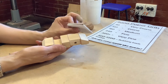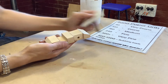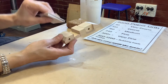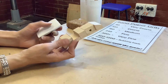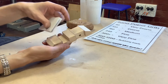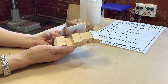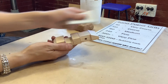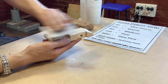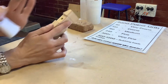The next thing I need to be really sure of when doing this is that I'm always sanding with the grain. It can be tempting when you have a line like this to just sand along it to get rid of it, but if I do that I'm sanding across the grain, which tears the fibers and creates scratches that are really hard to get rid of. Whereas when I go with the grain, the scratches I'm creating kind of blend into the grain, and the next grade of sandpaper is able to keep blending and smoothing that over.